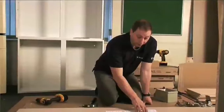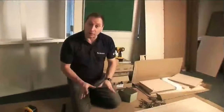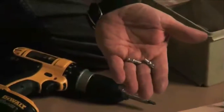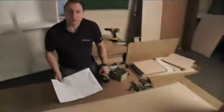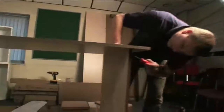My assembly guide says to use panel nine, which comes from your corner conversion pack. Following the assembly guide, I put my metal dowels into the panel where required, and at this stage I fit my shelf supports and wooden dowels as well. At this point you will probably require assistance to put the end panel onto your wardrobe, and then tighten the cams using a screwdriver.